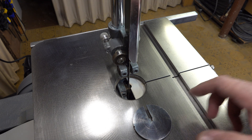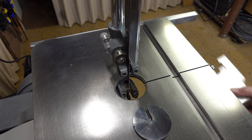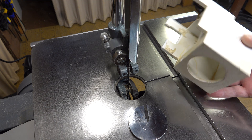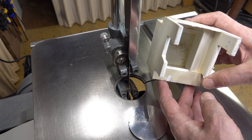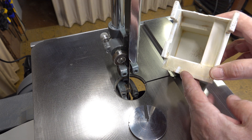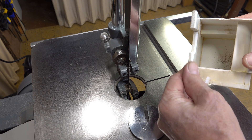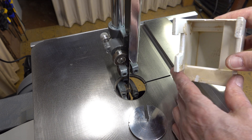Another thing I'll mention is you only need a friction fit on your hose. This piece doesn't need to fit inside here any more than just a quick friction fit because almost all those hoses are tapered. Here's a closer look at what's going on here. I have a little diverter on this side to make a little more vacuum — that's all we're really doing here. A couple of hooks on either side just keep it from falling off while it's in, and deburred inside edges where the vacuum is coming in so the vacuum can come in smoothly.